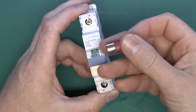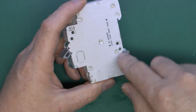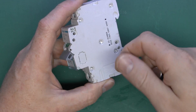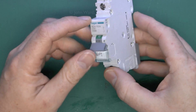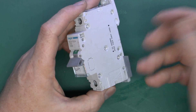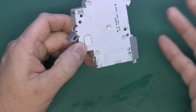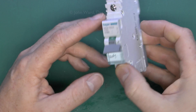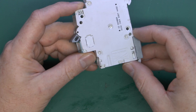As with the fuse, what's inside is a little strip that heats up. With a moderate overload it heats up fairly slowly; with a large overload, quickly. If it gets to a certain temperature, it will trip. The lift is only in use for fairly short periods — simply going from one floor to another. In this case it was heating up quite a lot, being around 15 amps over its rating, but not long enough to actually cause it to trip. In the last month or so this thing has presumably become damaged or worn inside, so now even a modest overload for a modest period of time will cause it to trip.